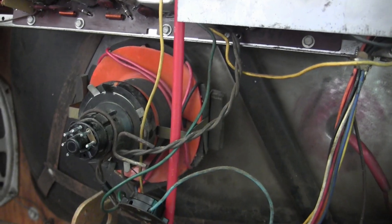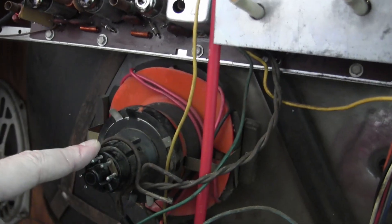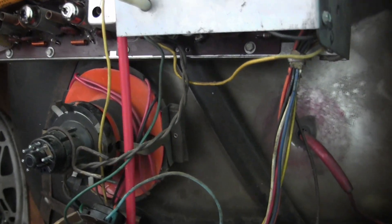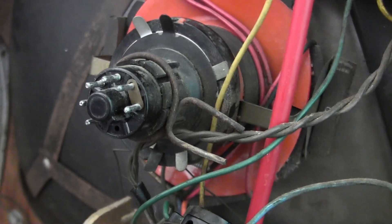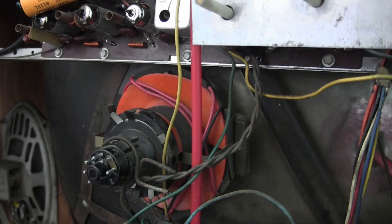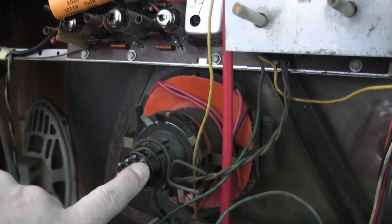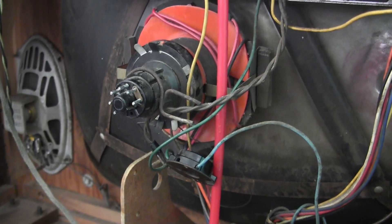When I mentioned earlier about these being able to be used in a Predicta — well, Predictas used this type. This one has this big base, so one issue is they're longer, and obviously you'd need an adapter which makes it stick out even further. Anyway, just a little bit of history there. That little shorting bar will be for focus — these use electrostatic focus. There's no electromagnet or permanent magnet around there to focus it. You can run a wire out to a control or switch for several focus options, or you just short it to one of the other pins that has a suitable voltage.